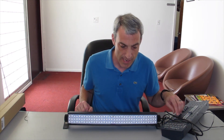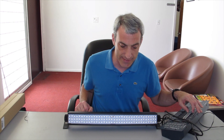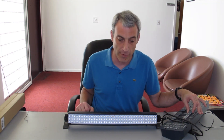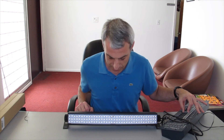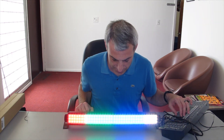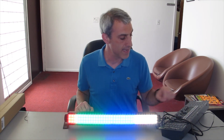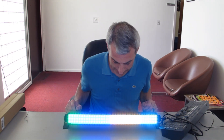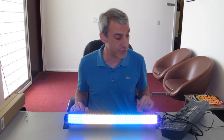Channel 8 is the automatic selection of running water speed from slow to fast. You need to go back into your color flow selection and get it moving first. Then if you bring up channel 8, it starts moving things around. Bringing it all the way up makes it voice controlled — you can actually have sound activation turning on and off through the DMX board. Let's go ahead and bring all these down again.